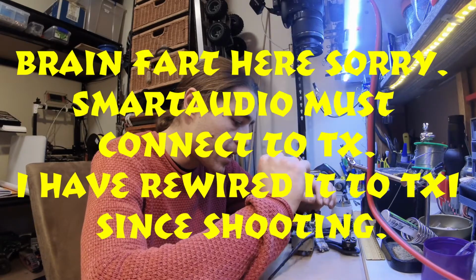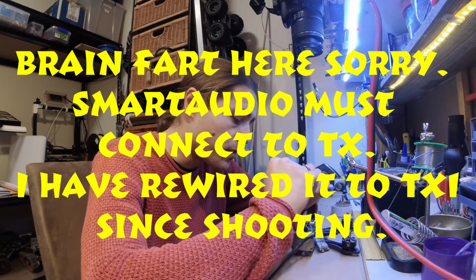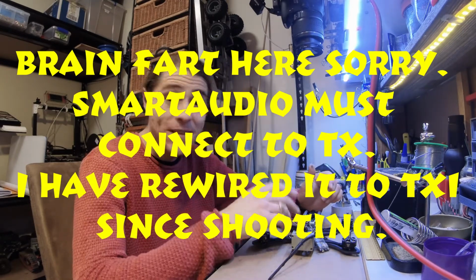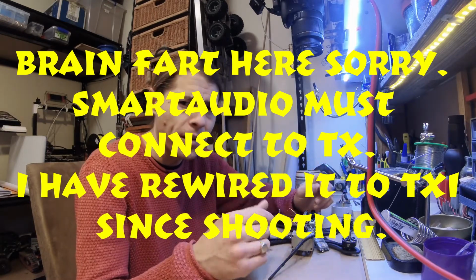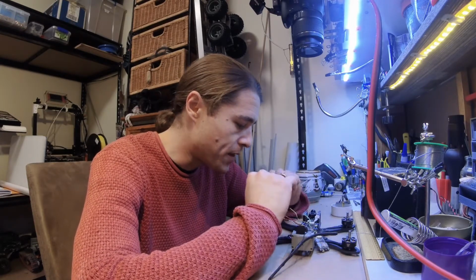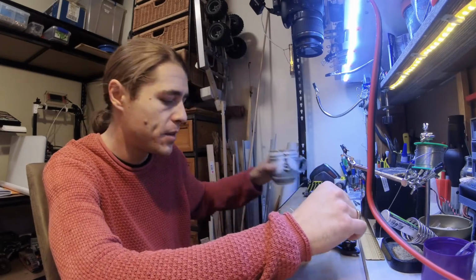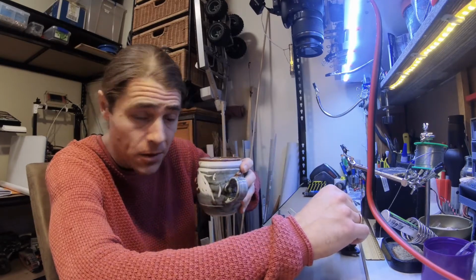G'day, Mike from the future here. Yeah, so bit of a stuff up there. Smart audio must be connected to a TX and not an RX of whatever UART you choose to use, and I have subsequently rewired it to TX1 because I'm using UART3 for the receiver. So yeah, sorry about that, and let's get back to the video.